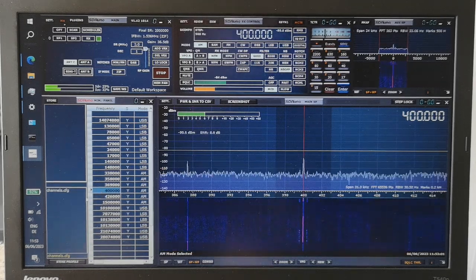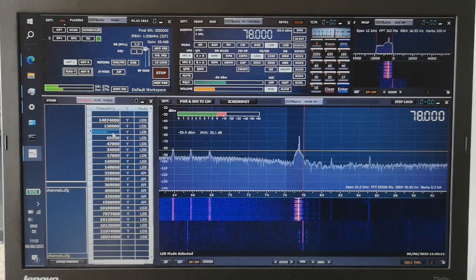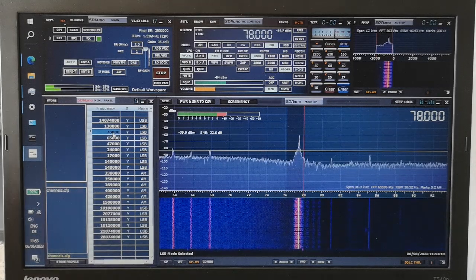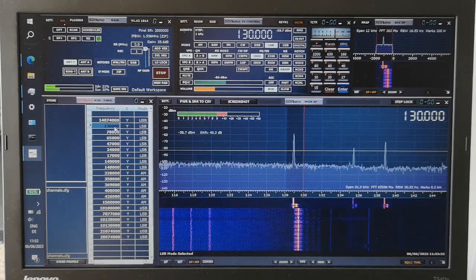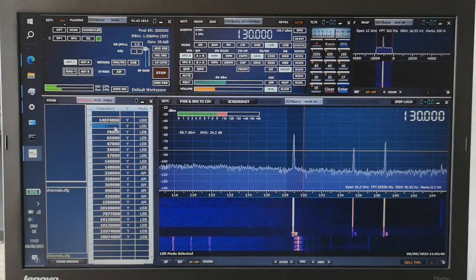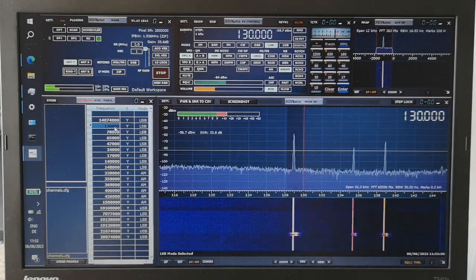At 400 kHz I've saved a few favourite frequencies. If we go down to around 78 kHz, there's a signal I'm not quite sure about — it sounds like a time signal that pulses at one-second intervals, but I've never heard it send its call sign. That's at 78 kHz on the PA0RDT MiniWhip, and it's quite a healthy signal. Also at 130 kHz there's something — maybe you can tell me what that is. It's a carrier with the odd burst of data occasionally, and it seems to repeat at 140 kHz — I don't know if that's spurious in the receiver or if it's really sent on multiple frequencies.